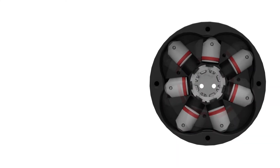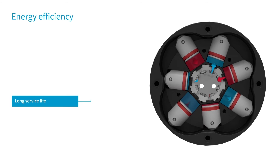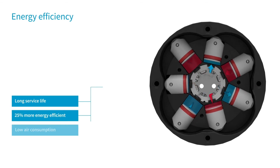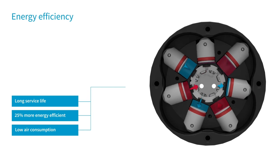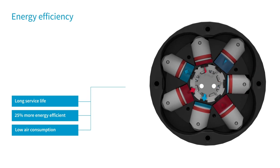So how are we getting controllable, reliable performance out of this motor? The answer is the centrifugal piston technology inside the slim compact design. There's less internal friction which decreases the air consumption by about 25% when compared to similar vane motor outputs. No vanes also means less service intervals — the PZB can run four times longer than a similar vane motor, saving you time and money.